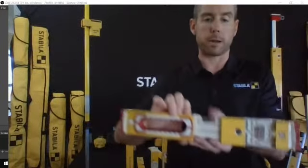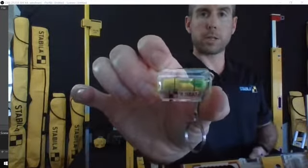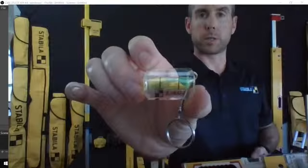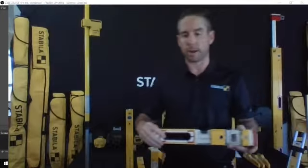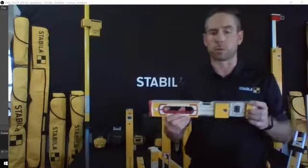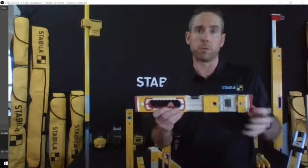So when you look at the spirit level, those two lines there are actually rings that are inserted by hand into the level. So it remains accurate. They're not going to fade over time, and they allow it to be read at pretty much any angle. So you will see, and I'll pull the vial back up for you to take a closer look, but there's also some gapping on either side of the bubble relative to those rings.